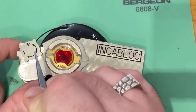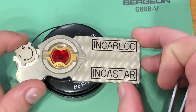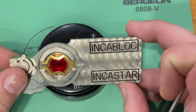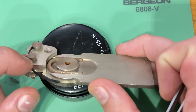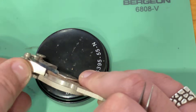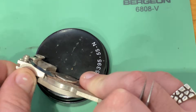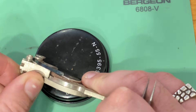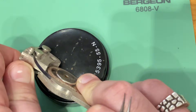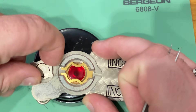And then we have the IncaStar, this system right here. It was invented in 1947 by Ernst Borl to simplify the fine tuning of watch movements. The idea is it composed of a free-sprung hairspring here, and you adjust it with this knob here by turning a roller in and out. It was a short-lived innovation as it proved impractical, and this system was pretty much dropped by every manufacturer by the mid-50s.